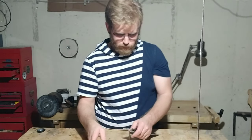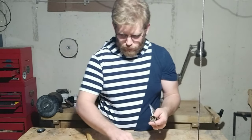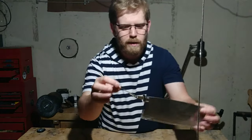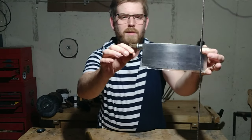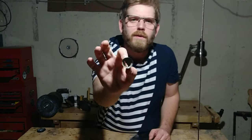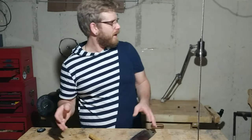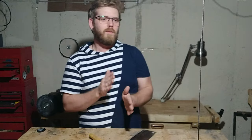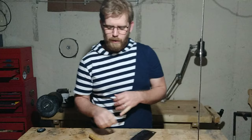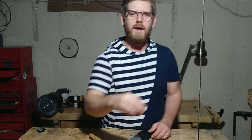Though this is a little more than I was expecting. It's got a hook, and it's only a partial tang, and I don't much care for this cap, so I'm going to switch this out for a piece of copper. What I end up using is some copper piping, and I make it myself. I will then cold forge it with a hammer to get the shape that I want, more like closing the opening up a little bit, just so it surrounds the handle better.